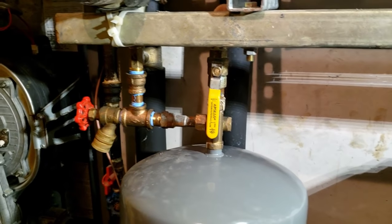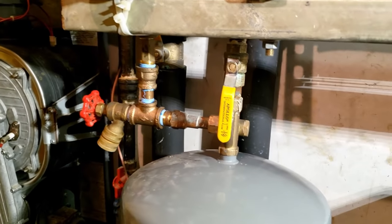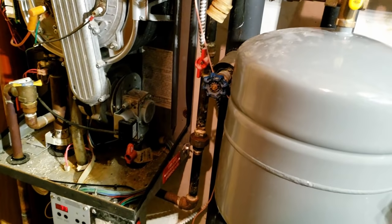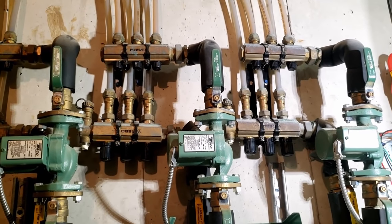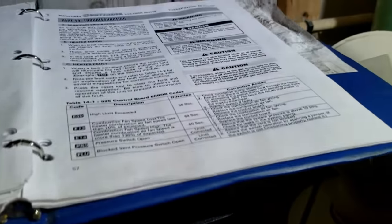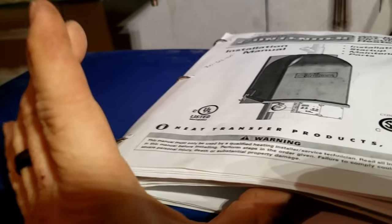We're good there. I prefer this over this other setup. The water's definitely coming back kind of cold — she's not ramping up very fast. This is all in-floor radiant heat with wooden floors, so it's not going to be set for very high temperature. I'm going to check through here and see what exactly it is set for, make sure it's set right. This book would kind of come in handy — I'm going to have to find the part number and download the manual.